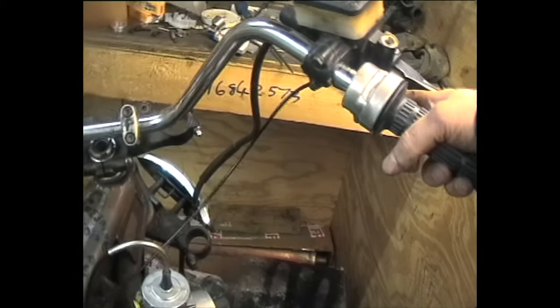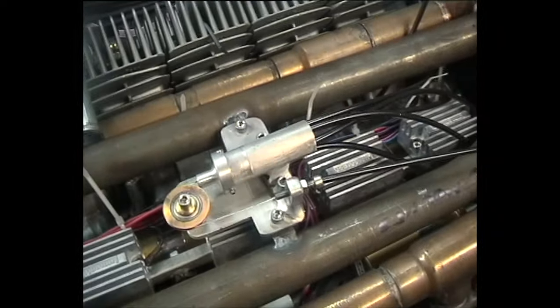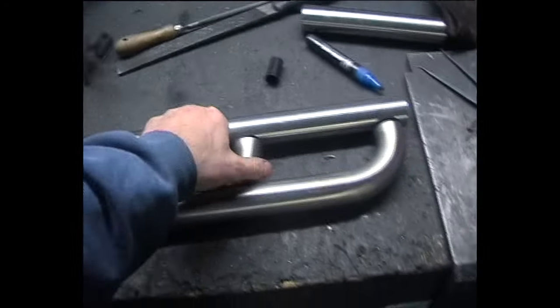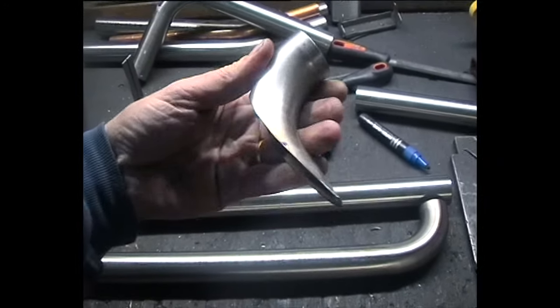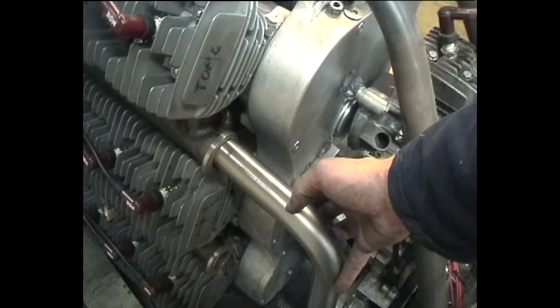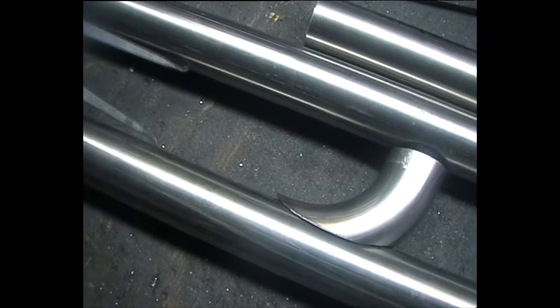Just finished off the last nipple on the throttle — it's a little stiff but it works. The last section of the exhaust pipe are the collectors. We made the collars previously. I've had the stainless steel tubing bent by a pipe bender and now I've simply got to cut them all to length, splice them together, and weld them up to the bike.